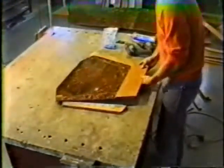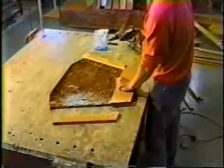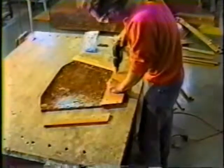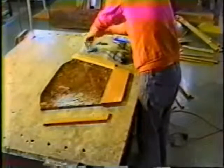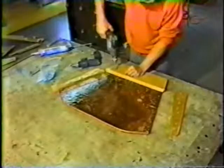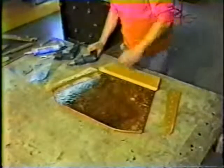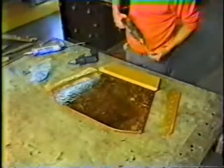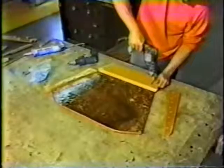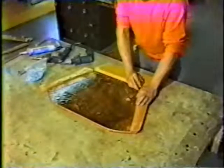Brush the edges of the pieces, then while carefully holding or clamping them in place, drill and counter-sink the screw holes. First, install two screws, one at each end when possible. For the transom braces, use number eight one-inch screws. Follow this procedure for all three of the transom braces. The pilot screws allow you to neatly reposition the pieces after the application of the adhesive and keep the pieces in place while the rest of the screws are put in.